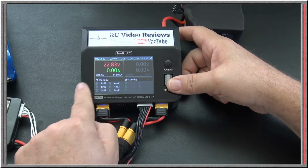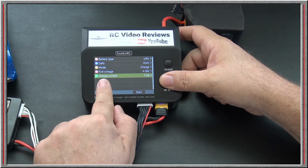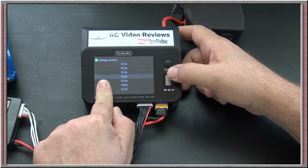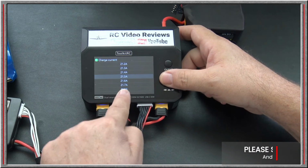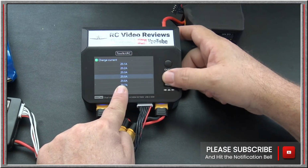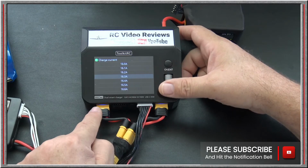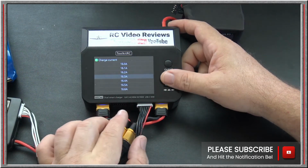We've got our 6 cell connected. I'm going to press the jog dial, and this brings up the profile. Now, the thing about the current is you can't have access to this current level beyond 15 amps unless you're in synchronous mode. If you're not in synchronous mode, you don't see this. This is not an option. The option stops at 15 amps. So by putting it in synchronous mode, you're telling the charger, hey, send current out both these lines and send it to whatever you're charging.